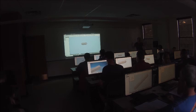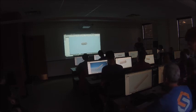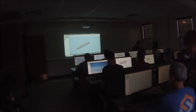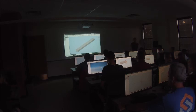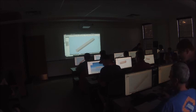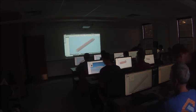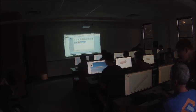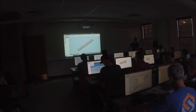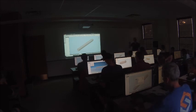When we have a hex shaft, we need to constrain it when we put it in the assembly. It has to be in a round feature, right? So we need a work axis. We talked about work features a couple weeks ago. Because we centered that hexagon on the center point, we can use one of the origin axes as the center line. If you expand the origin, it should be the Z axis. If you right click and turn on the visibility, now you've got an axis that goes through the center of your part, and you can use that axis in an assembly to constrain it. I use a lot of work axes to constrain things, because it's easier than trying to select weird cylindrical geometry.